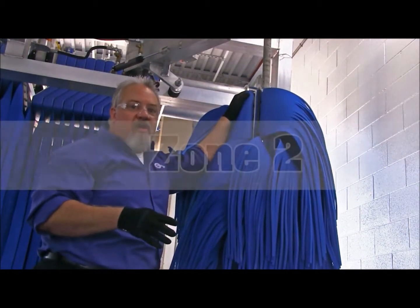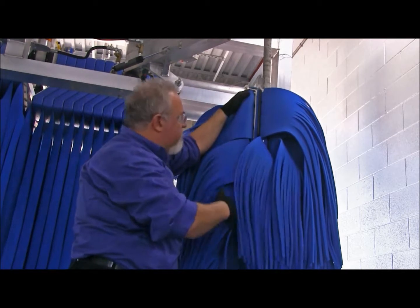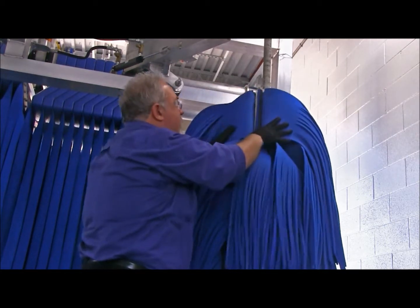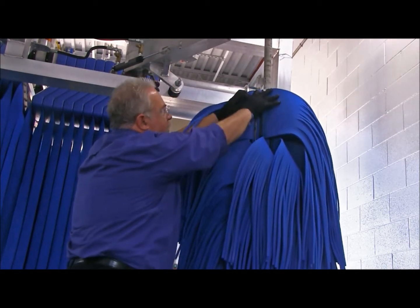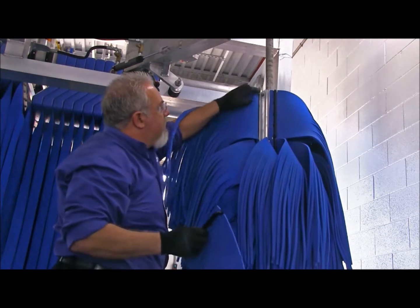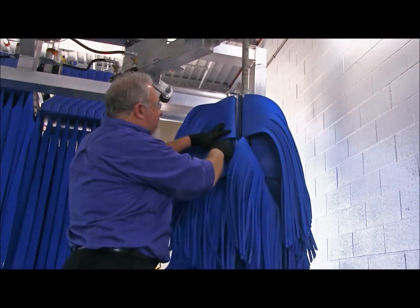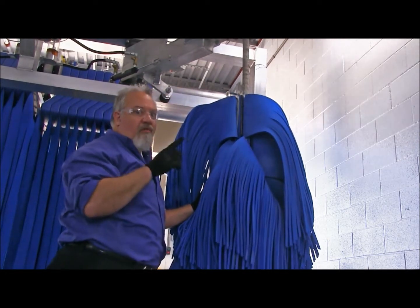Okay, each one of your gyro brushes is made up of two sections. You have an upper section and you have a lower section. The upper section is a 6-inch hub which is connected to the shaft going up to the motor. Now, each hub has fasteners that go down the side of it. Here, I'll pull that wash clip out. You can see the fasteners, and there is a row of them going all the way down. All right, now as we're inspecting the 6-inch core, the upper part of the brush, and again, remember, we're going to do this to both brushes.